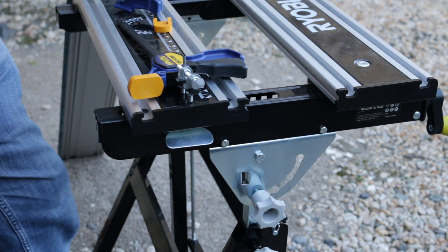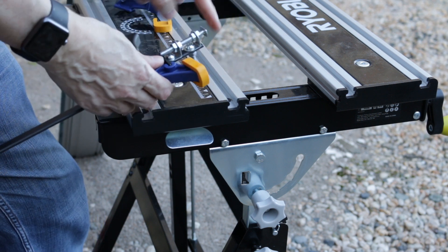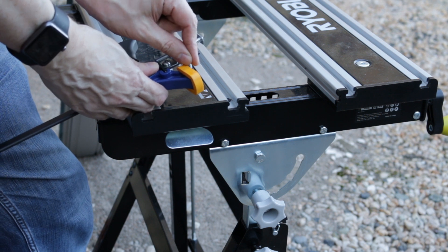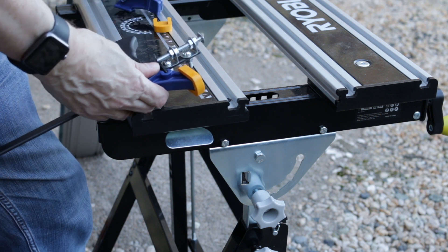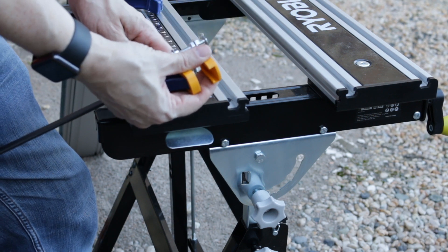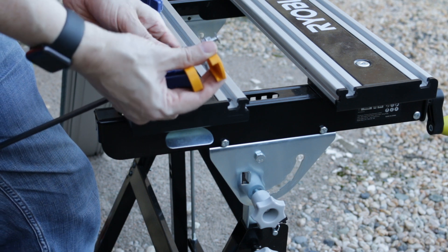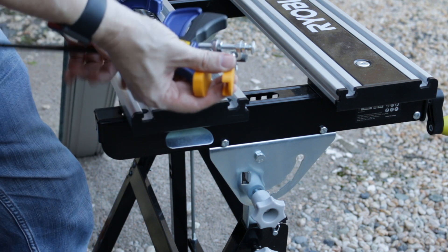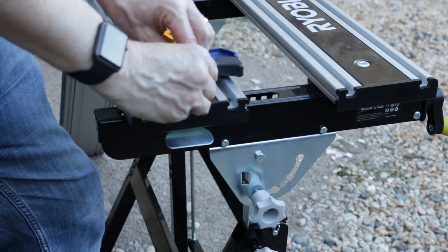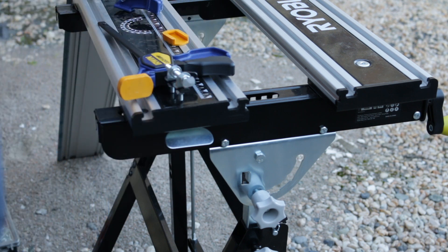It's catching on there and releasing whenever it comes up - two solutions come to mind. If you're clamping a thin piece of stock, you want the distance between the two contact points to be about the same thickness as your piece of stock. You could glue a piece of wood onto the top and that would work. The other option is to just take off the bottom bracket and see if one hole is stiff and secure enough to hold it.